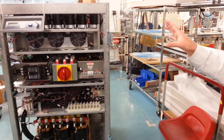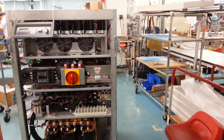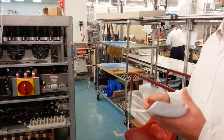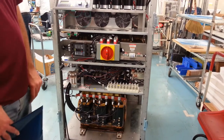So it'll take whatever low voltage you have, boost it, chop it up to the 400 volt bus rating, and keep that inverter running. It'll never know that anything happened. And still produce, in this case, 150 kVA running full load. That'll be proportional to how long your battery cabinet is — could be 5 minutes, 8 minutes, 10 minutes, could be 30 minutes. Customers put many of them in parallel — could be an hour. It's all up to the customer how long they want to keep their load up.